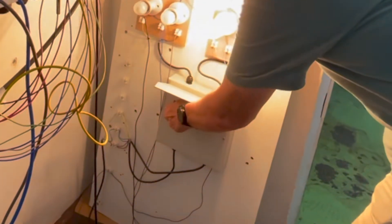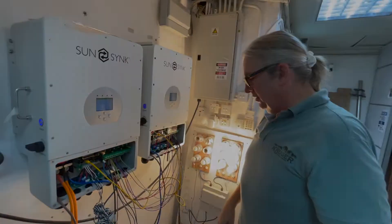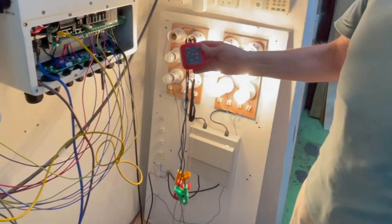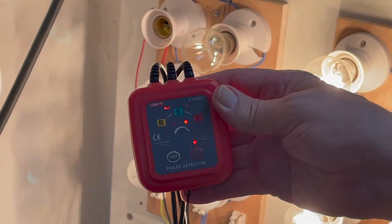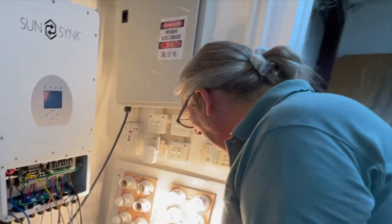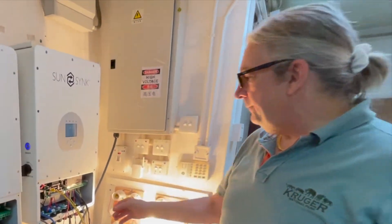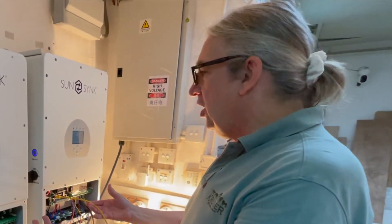This is a motor, so we've now got a three-phase motor running and we've got an incandescent load. You can see perfect phase rotation — of course it's got perfect phase rotation because it's running a motor, and the motor is not pouring smoke, so we know it's working fine. Two inverters in parallel.